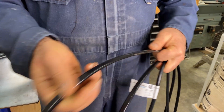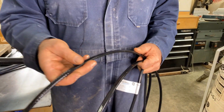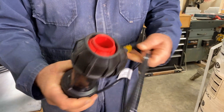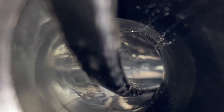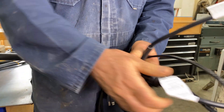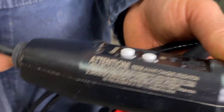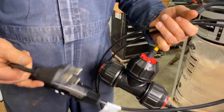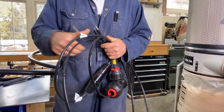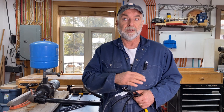This is the actual heating cable. It needs to be sized at the factory — you don't buy it off the spool and cut it to length yourself. You have to send in the order and they make up the cable accordingly. This is the fitting that will splice into the water line. The cable is pushed into the water line as well, so it's completely surrounded by water — the most efficient and reliable arrangement. For safety, there's a built-in GFCI ground fault circuit interrupter, which makes this system a whole lot safer. It's actually required for these sorts of systems, but not all systems have them built in. This is a complete package and when it's installed you just plug it in. It's a self-regulating cable, which means it delivers more or less heat depending on the temperature — that's part of the reason this system is so energy efficient.